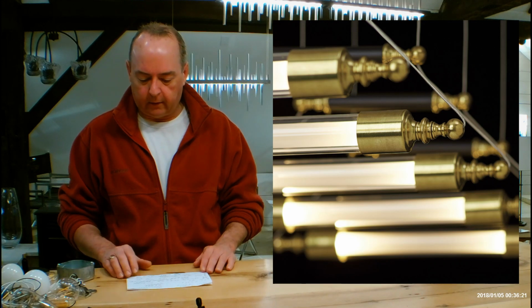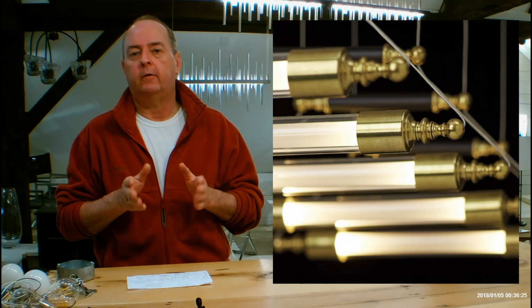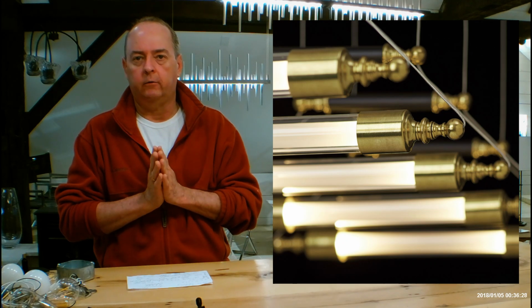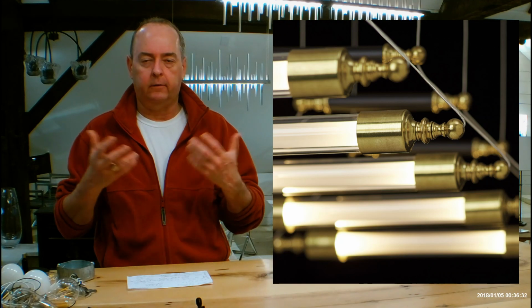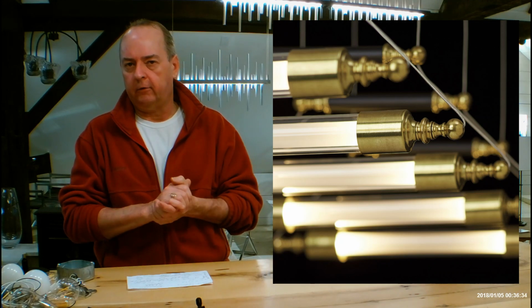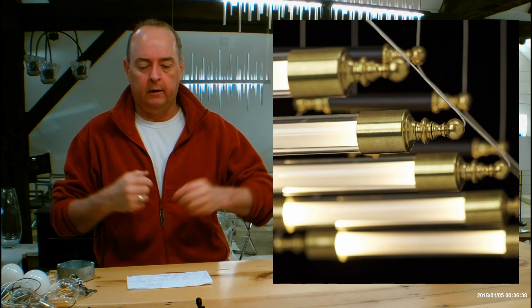So a couple things. You want to put this on a dimmer, I think. I would expect you would. Make sure you tell your installer that you're going to be using LEDs. The limit as far as the heat generated by LEDs, which barely generate any heat, is going to be 4 watts inside of each of these, 2 4-watt LEDs.